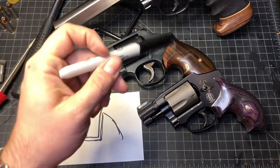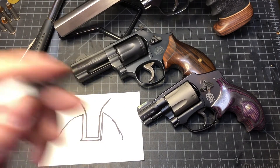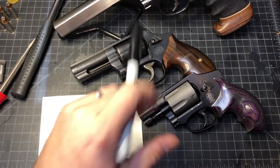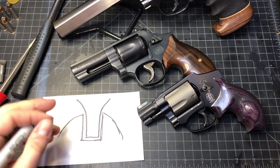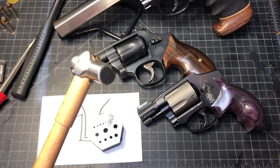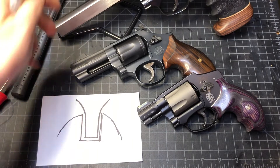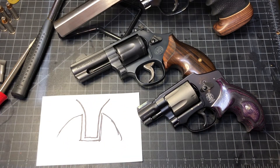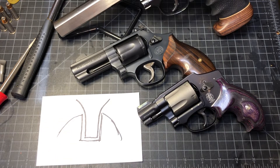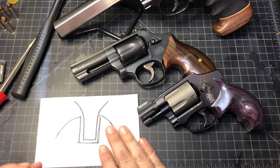We've got a couple of older guns here. The one I showed you in that earlier video has some really beat-up screws on it. We can fix that — we can use the jeweler's block and a polished hammer face, take those burrs back out, massage those areas back down, and then recut the slot. It's not really a problem, we can do it.